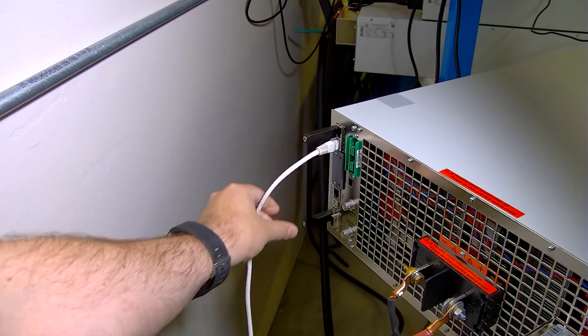Take one of those and we're going to plug it into one of the two master-slave connections in the back. Remember, it doesn't matter which connection you use — there are two of them. This makes it easy to daisy-chain several units together. There's no specific order for the master and auxiliary units; it can be the first one, the last one in the chain, or anywhere in between. But there are some terminations that you do at the beginning and end of the string — those DIP switch settings are in the manual.